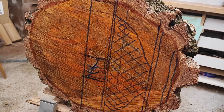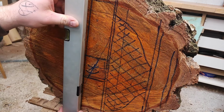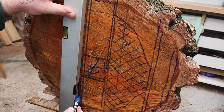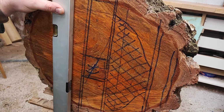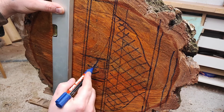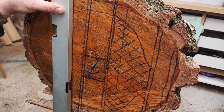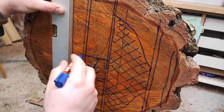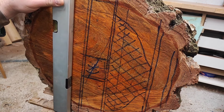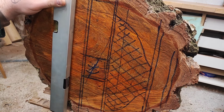And on this side, I'm going to do another chainsaw curve cut. Now, usually I don't go on marking all this. I just know when I see this kind of blossom cracks here, I cut out the section, and then I just calculate and do this without any drawings, just faster that way.